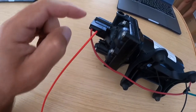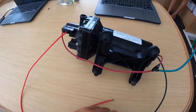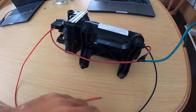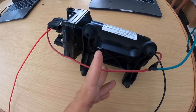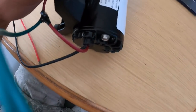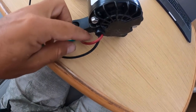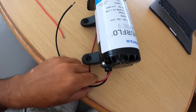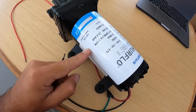I'm gonna show you how you can tell if your switch is not working and just test the motor on your pump. You have two cables coming out of the switch — one goes to the positive 12-volt power, and from the back you have negative and positive. Positive goes to the switch. What you want to do is take the cable, cut it or open up the switch and disconnect it, then make sure you have both cables — positive and negative — coming out of the motor. Connect those to your 12-volt supply and it should turn on.